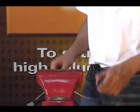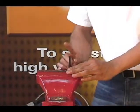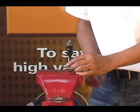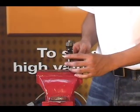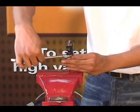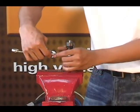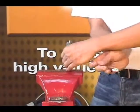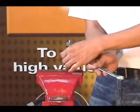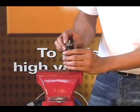Clamp the 1/4-inch hex wrench in the vise with the long end facing up. Now place the clutch assembly upside down on the 1/4-inch hex wrench, and use the 17mm combination wrench to loosen the adjust nut. Note, you should be careful to not loosen the 4 steel balls when loosening the adjust nut. Remove the 1/4-inch hex wrench and the clutch assembly from the vise.